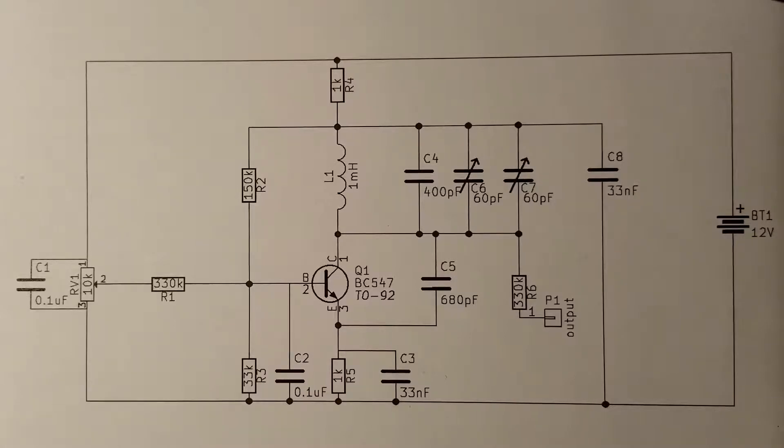The pitch reference oscillator works in the LF band, also known as low frequency band. This is a radio frequency normally used for navigation and for RFID devices, like those in cell phones and some credit cards. The theremin uses this same LF radio band, and in particular it works at around 172 kHz. The oscillator used for this project is a so-called tuned amplifier oscillator.